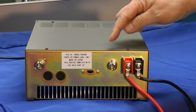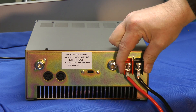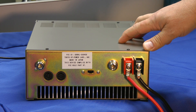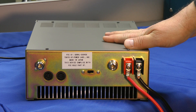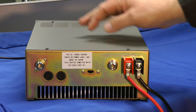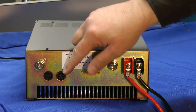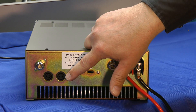Here's your antenna connection. Your transceiver gets hooked up here. Here's your DC power connection — I like this because the terminals are protected with little ears. This is your drive level switch; there are three drive settings: the 10-watt position for 0 to 10 watts, the 25-watt position in the middle, and 50 watts on the other side. The RF sensing relay that keys the amplifier kicks in at about 650 milliwatts, so you could even drive this amplifier with a 1-watt handie-talkie if you wanted to. There's also an accessory plug and a keying/remote plug for connecting to your transceiver.